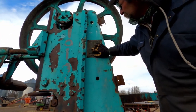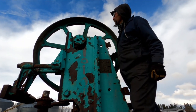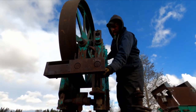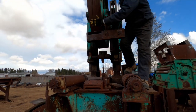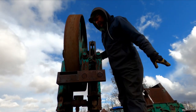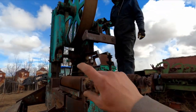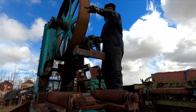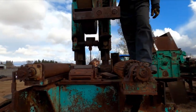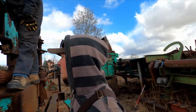It's the five-foot right-hand band mill, number 28, Klamath Iron Works. So that means the wheel is five feet. Cut the timbers through here and the band came down through here. The wood went through like this, and we cut it off whatever thickness you want, then bring it back around and run it through again. It wouldn't go back and forth — it went through, crossed, and a merry-go-round system they called it. These are all the feed rolls, and then we had that line bar here — that's what moved in and out to give you the width of the lumber.